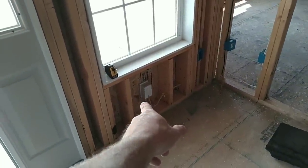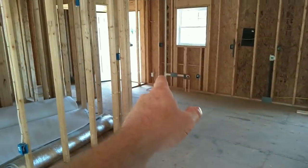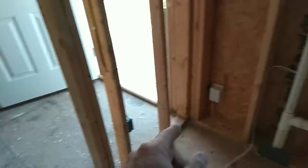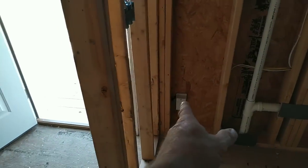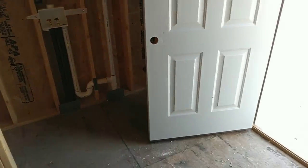That's the back of the outlet — it's an Arlington heavy-duty in-use box, vertical with white lid. The other outlet serves the back deck area. This outlet can also be classified as a service outlet for the heating and air equipment — the condensing unit is going to be located right there outside the wall, so that outlet has to be within 25 feet of the equipment to count as a serviceable outlet.